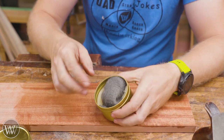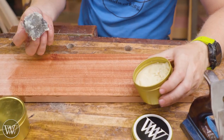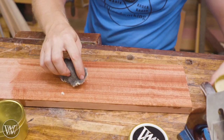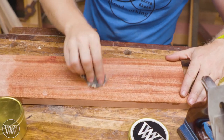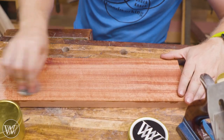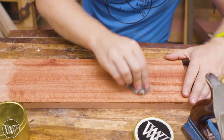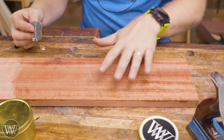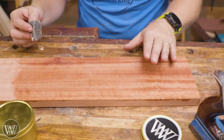First let's take a look at the soft wax. This is what has the thinner in it and what I use to help finish wood. So after I put my finish on — you can see my coat of boiled linseed oil — I'm going to get a little bit of wax on a steel wool pad that I keep inside here and spread this wax on really nice and thick. Rub it around, let it fill in all the pores. The reason for the wax is to fill in those pores, level out the surface, and get a nice clean shine. I'm going to let it sit until it's getting dry to the touch.